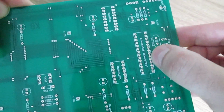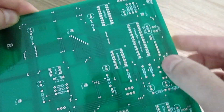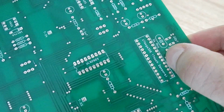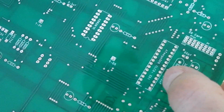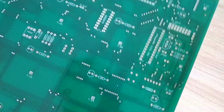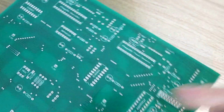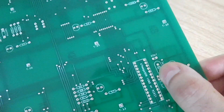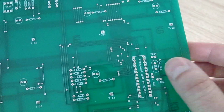The Arduino compatible 328 chips. This is for the sequencer and LEDs. This is for the touch sensors. We have 18 touch sensors. We don't use buttons here. This one for the LCD and the SD card, which is optional on the board, so you don't have to add this one for the LE version. The LE version, you just need the two top ones. And the bottom one can be for the MIDI output on the full version, or a sound generator. We have 8-bit sound generators for now, but later we can add some more options.